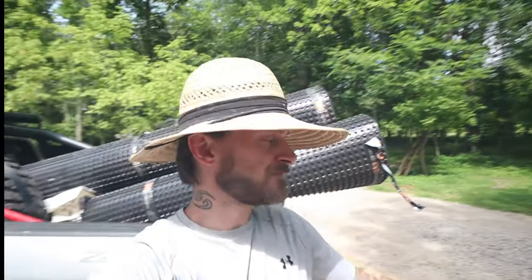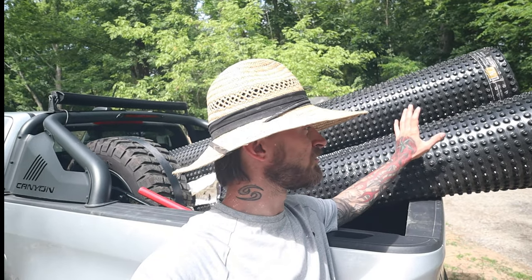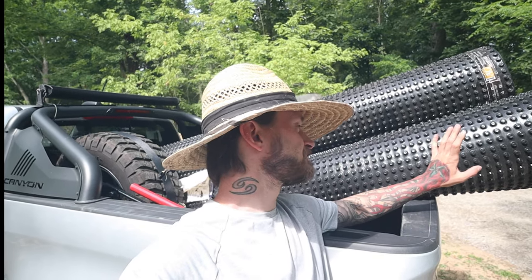This stuff here is 7'3". They also make an 8 foot. So for a normal size basement, that works for them. But we are going to have to cut off some of the bottom here because I'm not going up 7'3". You could, I guess, but because we're going to be using a stone facade on the bottom, or if you're bringing siding all the way down, you obviously don't want to have the siding coming down and hitting this for a good foot or so, because it's going to push it off of the house and then you're going to have kind of a bow at the bottom. So you are going to have to cut this to the length of where your grading is going to come up to. Now, this product here, I'm not exactly sure how I'm going to install it yet.